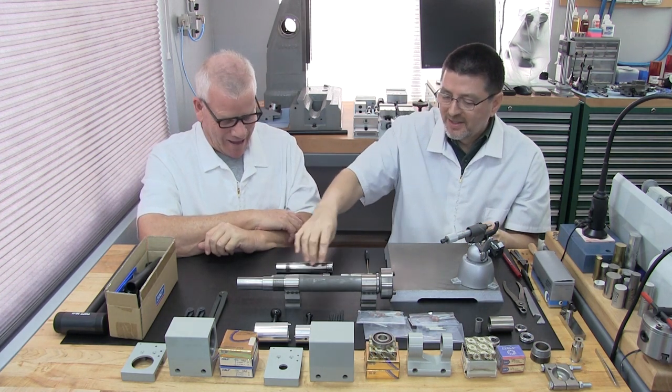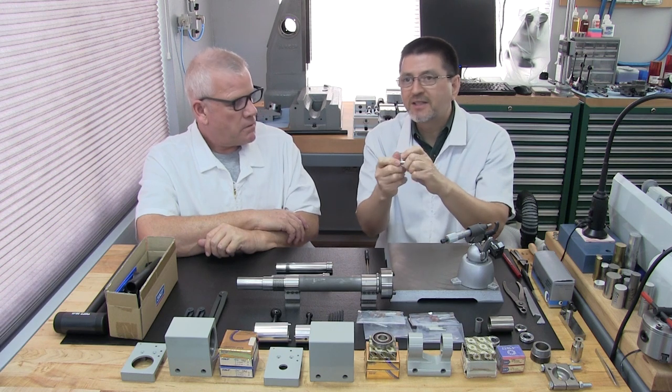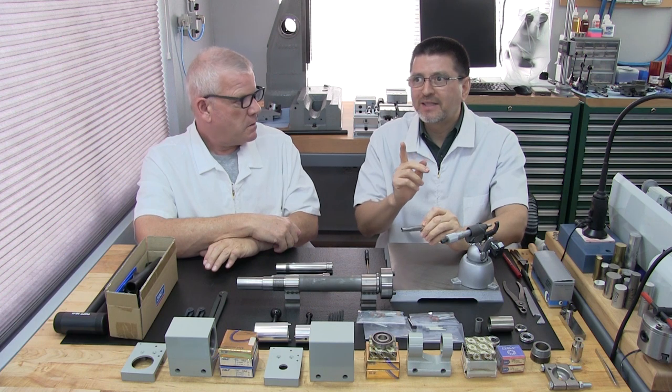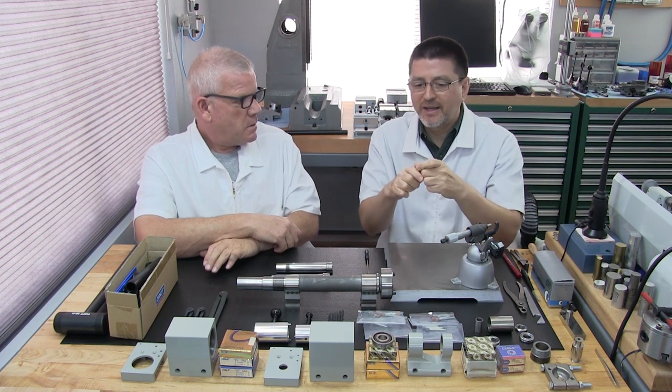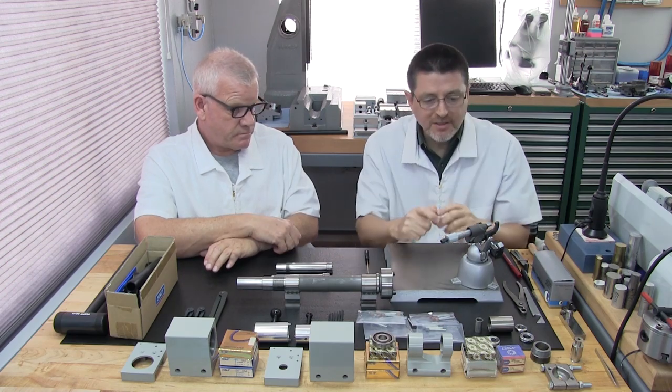This is really easy. Remember, I've been holding on to this. Temperature affects small items. One micron readings do get influenced by holding the part, so keep temperature in mind. It's a big deal. So let's get started.